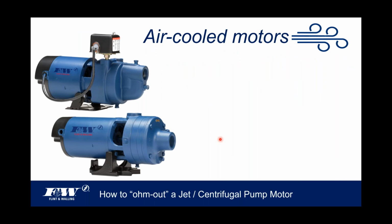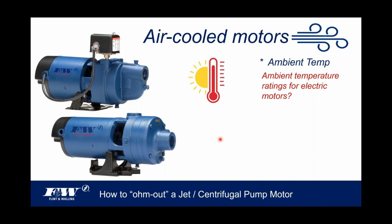Let's not forget these are all, of course, air-cooled motors, unlike their counterparts, a submersible pump motor, which is water-cooled. These are all air-cooled motors, and that's pretty important when we look at what can cause situations that would create a heat rise, okay? A heat rise. Well, obviously, ambient temperatures can do that.